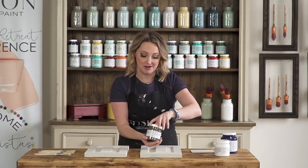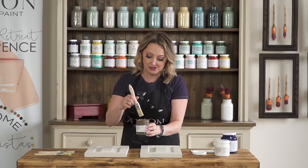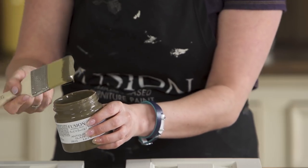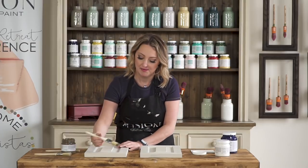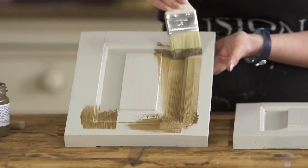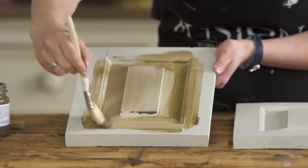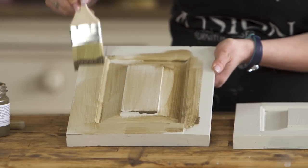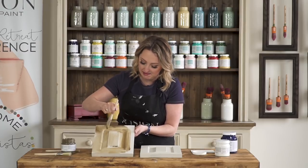Why would you use glaze over top of or instead of a wax? Waxes are really fabulous but they do take quite a bit of elbow grease. I'm going to use a little bit of glaze — you don't need a lot, and this is a really inexpensive brush. I like to brush the glaze on and then just wipe back the excess. Now because we are using this over top of Fusion Mineral Paint which has a built-in top coat, you don't have to worry too much about the glaze drastically changing your color because it has nothing porous for it to really seep into and soak into.